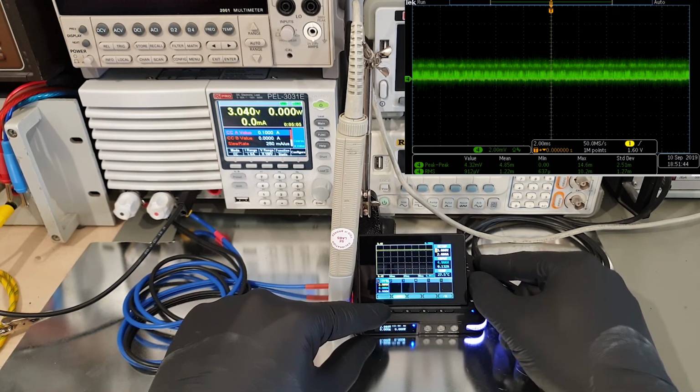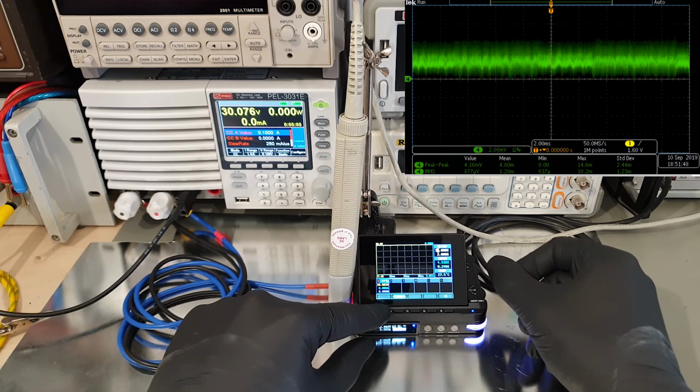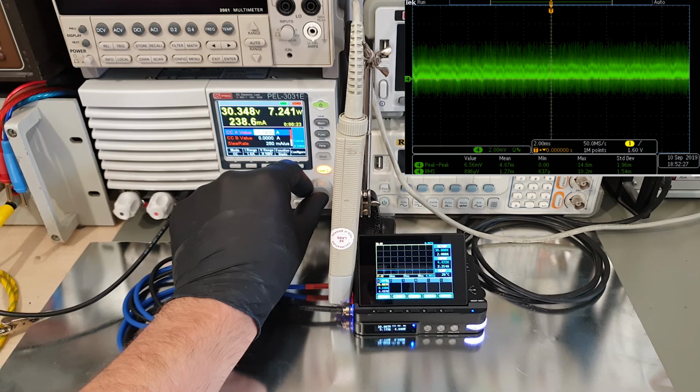Now I hope I can make it sweat at least a little bit by boosting 5V in all the way to 30V out. Well, the internal temperature, according to that number on its display, doesn't really seem to change a whole lot in any scenario so far. But at least we are getting some more noise now, confirming that the thing in fact has to obey those same annoying laws of physics that are making my own power supply design so damn difficult.